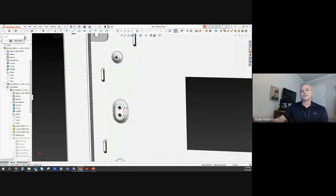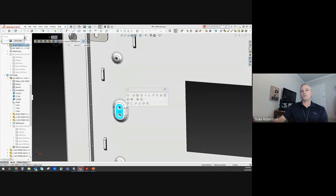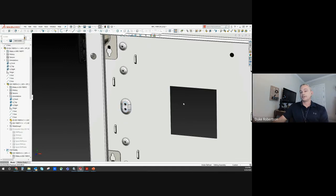Another nice little convenience feature is this here. This is a grounding point for a dual lug grounding wire. We mask this area at the factory prior to powder coating. So essentially it's ready to go. It's already prepped by us. When you get it in the field, all you do is remove that masking tape. You have bare metal already. Just attach your grounding wire and it's good to go. You got your bond.